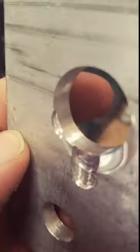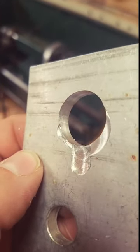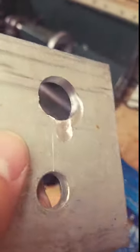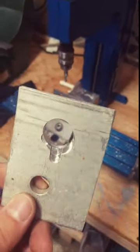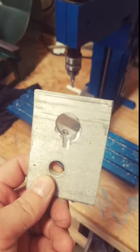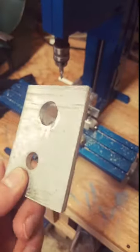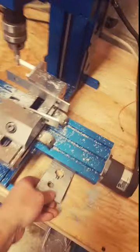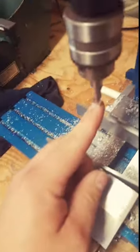Let's see if we can get you some surface finish. I'm not a machinist, but I call that reasonable. If I get my shaking hands here. There we go. I'd call that reasonable. So, can you mill aluminum on the Maxnc 10? The answer is yeah. I mean, you don't want to go too slow in aluminum, because then you'll heat up this bit to the point that she's no good. She's just no good at all. You know what I mean?